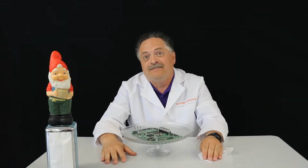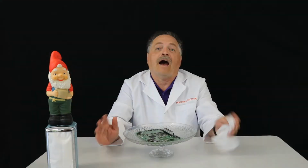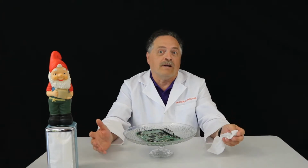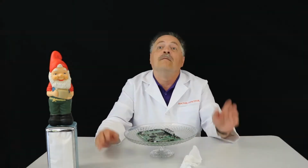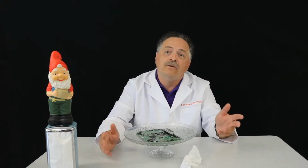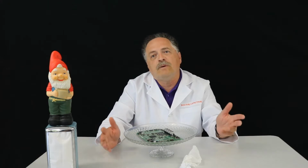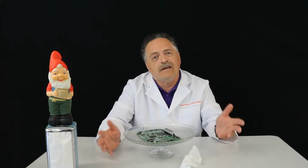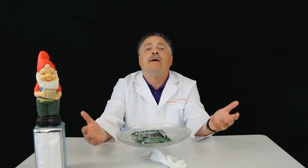Now that's done, it's time to clean the circuit boards. Like dirty dishes. I hate PCB cleaning so much, I went and got an intern to do the dirty work for me. But be careful. You can't use any old chemical to clean the PCB boards. These days, most people use deionized water called DI water or alcohol-based solvents. But back in the day, early PCBs were cleaned with Freon. But the halogens in the chemical would destroy the aluminum electrolytics.